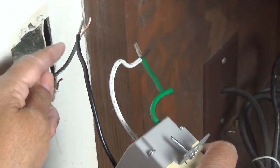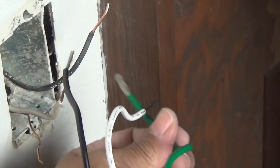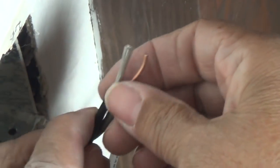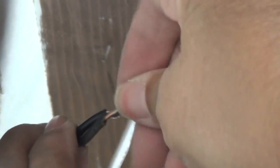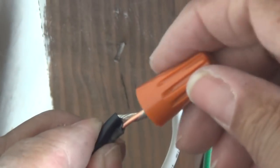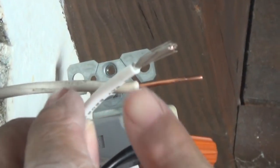Here's our new outlet — let's connect it. Just keep in mind: black wire to black wire, white wire to white wire, and the green wire is our ground, so it goes to our bare copper wire. We're going to attach our two black wires — that's our hot. I'm going to try twisting them first before I put on my wire nut. I'm going to twist the wire nut on and get it real tight — I don't want any bare wire showing.